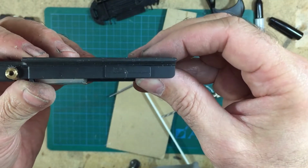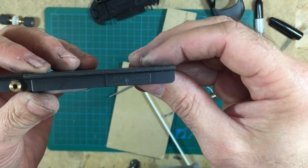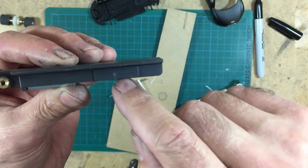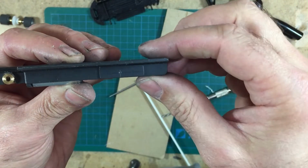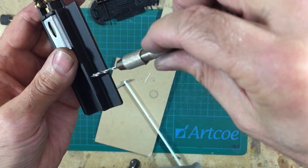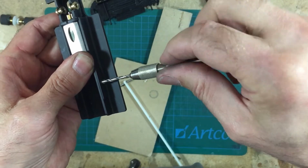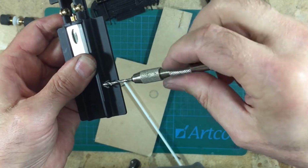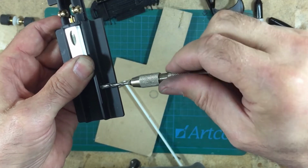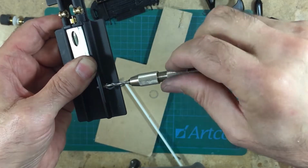So that has put that, and if that little pip that you've started with your drill isn't quite on the line, adjust it. Well, you can adjust it with the guide off, up or down, whichever way. It's pretty easy to do once you're at this stage. And once you've got that little mark, you can then simply drill it through, and that should, in theory, be exactly where you want your wheel centered.